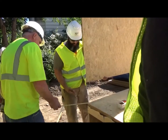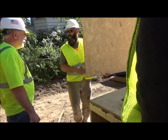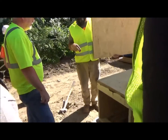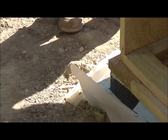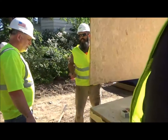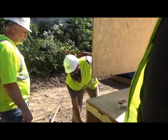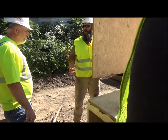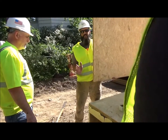Up against the plate — this is the fastener plate here, down low. That plate down there is structurally anchored to the foundation, and that's what we're actually anchoring the wall into. So the most important connection on this wall panel is this bolt, horizontally driven through the panel into this plate. We also want to run a bead of glue across that, so that's a glued-and-screwed connection.